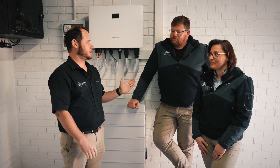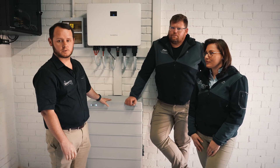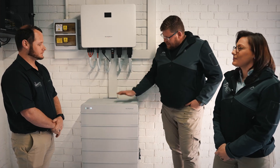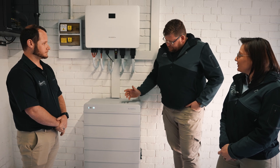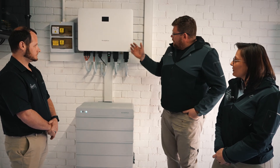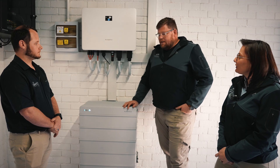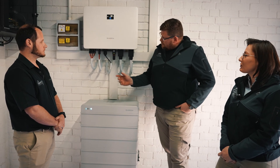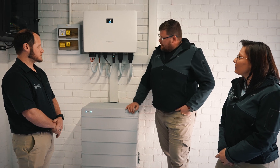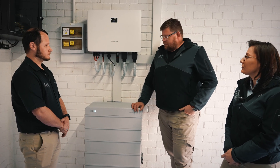Today I've got Karina Hubert and Franchua Hubert from Lunor Solar, telling us a bit more about the SunGrow 10 kilowatt inverter with a 19.2 kilowatt hour battery bank. What we like about this unit is firstly it's very space-saving — we've got 19.2 kilowatt hours in a very little space. From an expandability point of view, you can expand in 3.2 kilowatt hour modules at a time, so it's a cost-saving efficiency. On the inverter itself, what stands out is obviously the fact that this is 200% PV oversized. They offer exchange warranty and not a repair warranty, so it's a quick turnaround time. The support system is locally in South Africa and most of it can be done online, so there's no need for revisits to sites — you can just get a tech to help you.